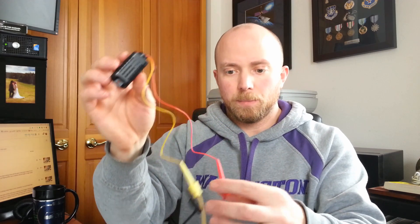I'm on to the temperature and humidity sensor now. I got these little micro grabber clip wires — I saw someone using these and I just had to have them. I hooked one onto a temperature humidity sensor and was able to get a reading off it connected directly to the board. So that means the one wire bus works and the temperature and humidity sensor bus works. Now it's on to getting the connector from outside the system to the temperature and humidity sensor to work. The one wire bus, the LED light connector for the CO sensor, the temperature and humidity sensors, the digital bus, and the 5 volt and ground buses all work and checked out — no rework required so far.